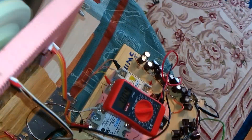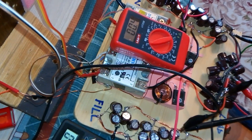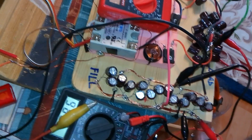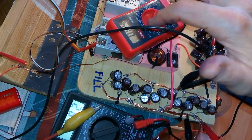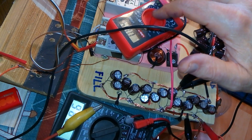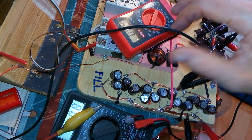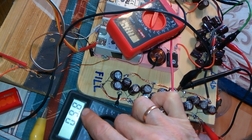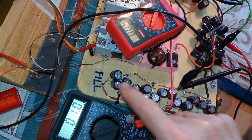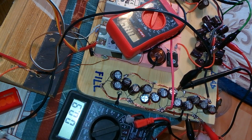Here's the motor going. This is going to be the voltage in the final cap, the one that goes to the load, and I don't have a load on it now. Right here, this is the voltage into the fill cap, which is still 1,400 uF.